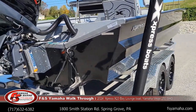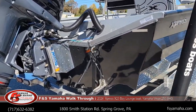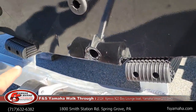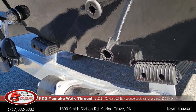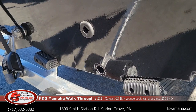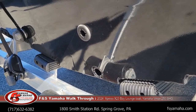Express has quite a reputation for ride and handling in the industry. And what makes that is their hyperlift hull. They have a hyperlift pad hull — at the very bottom of the boat there's a pad about 12 inches wide and about two feet long. So when the boat's running fast with the motor trimmed out, the only thing in the water is the pad. That makes the boat ride better because there's very little of the boat in the water, and it makes it go faster as well.